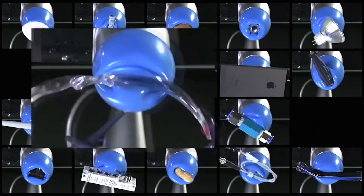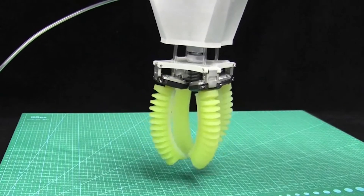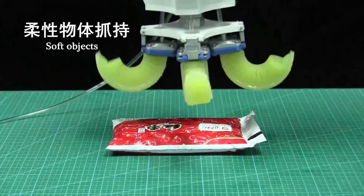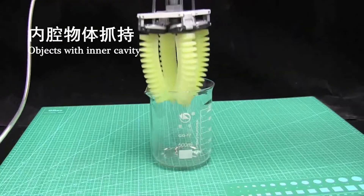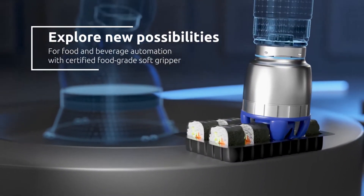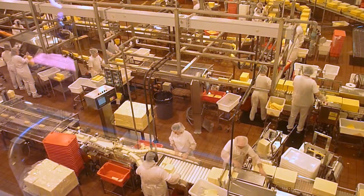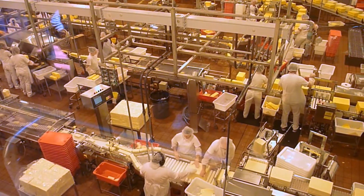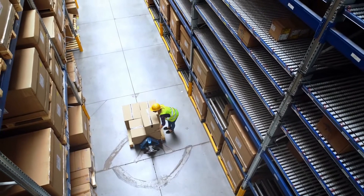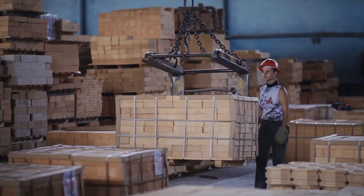The disadvantage of this type of gripper is that it has difficulty picking up heavy items, its grasp is imprecise compared to other methods, and the flexible plastics and rubbers need to be replaced after some time. There is also less control of grip force because it is pneumatically actuated compared to electrically actuated end-of-arm tooling. On the positive side, these grippers are helping to address labor shortages in packaging — jobs that involve repetitive manual labor, sometimes in freezers, with heavy loads that can lead to repetitive injuries and high turnover.